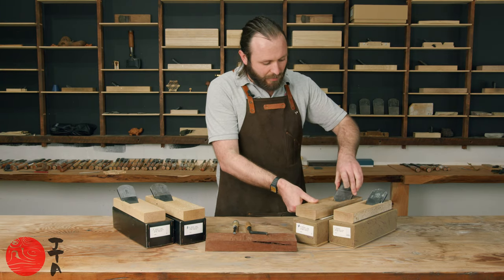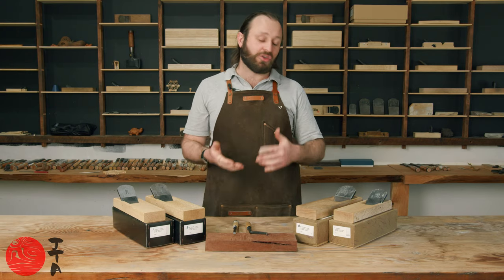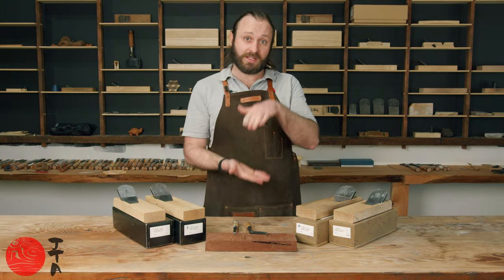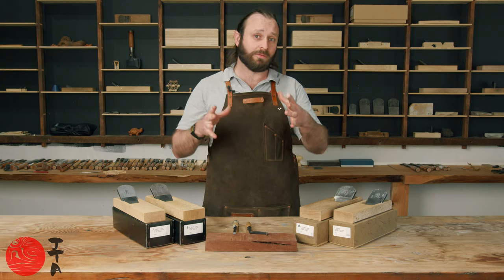So what's it for? Some people take the Tsutsumi to be a sign of an extra level of quality in a block because it is harder to manufacture and shows a lot of care in the processing. It is also considered quite good for stabilizing a blade and reducing chatter in a cut. This is why it's mainly found on larger planes where you have very wide cuts with quite a lot of force in them.